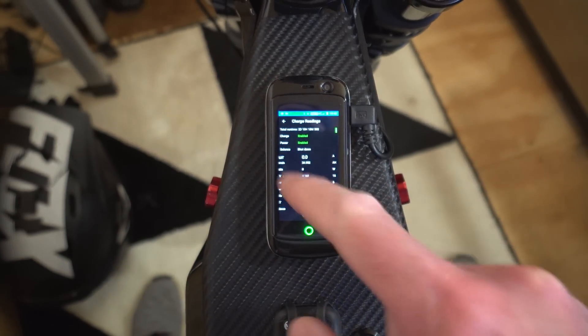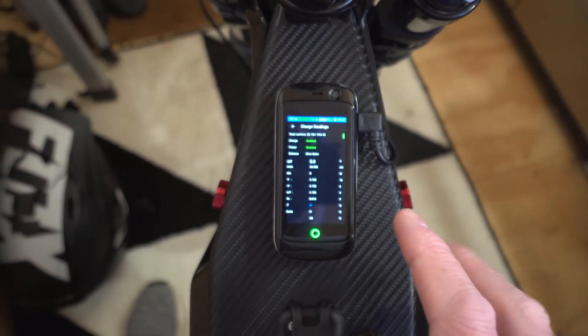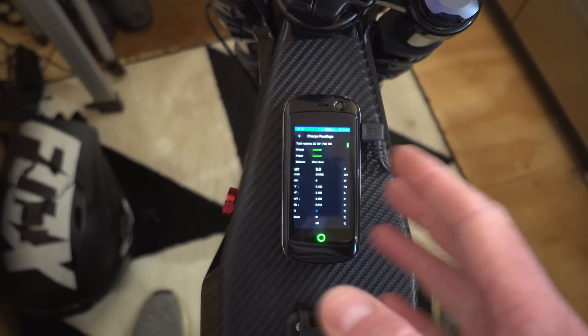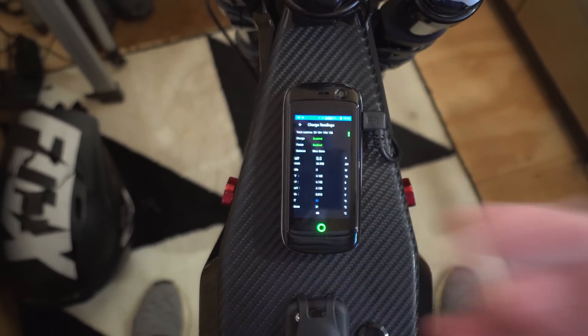I had a couple of messages with Tony because I was panicking that one of my cells was discharging overnight, but it was only losing about 0.005. The ability to change your settings based on the battery and exactly what you're going to do with the bike is fantastic. You can actually do it while on the bike — just pull over, make some settings changes, and carry on riding. It just doesn't get better than this.